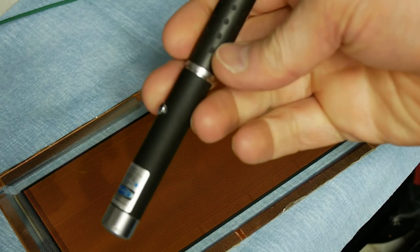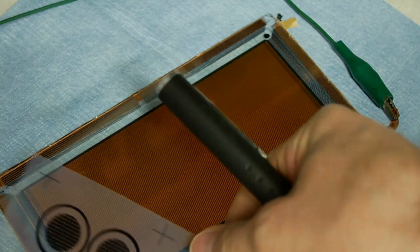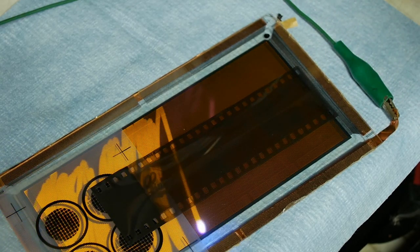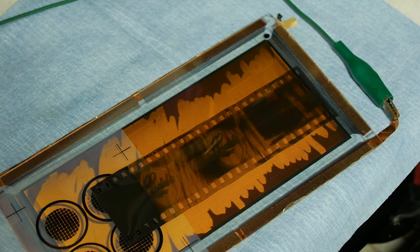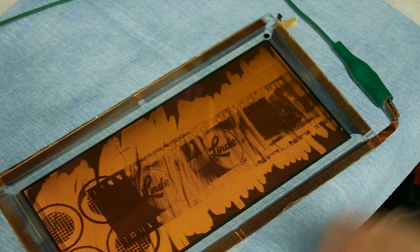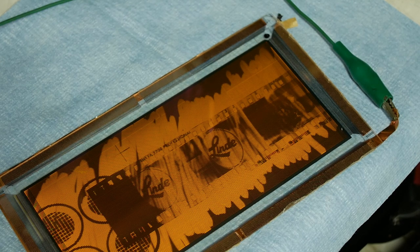I mentioned weird input-output, and we know this thing can work like a light pen. But what else can we do? Wouldn't it be interesting to have a transparency or even a 35mm film negative and see how that works out? Not bad at all. Only half or three quarters of the pixels are running, but it's still more than enough resolution to capture an image. It leads to the question: could we use this as a readout? Could we put a drive circuit that could both display an image and read in light pen information and even scan images from the user? It's a weird kind of futuristic display that's a scanner, a camera, a light input device, and a display all at the same time.